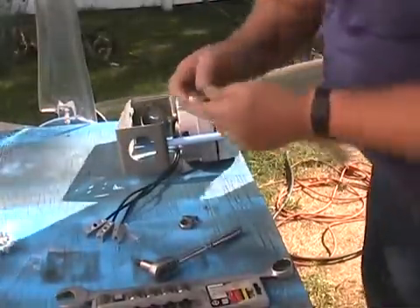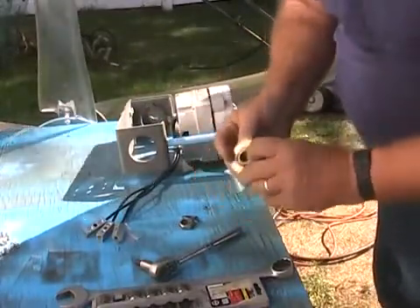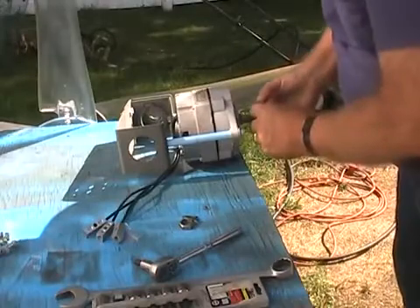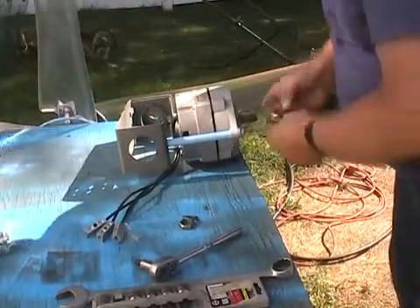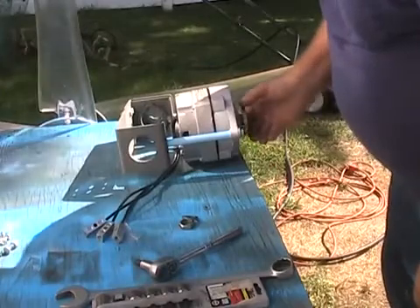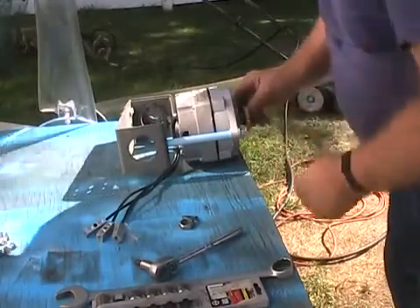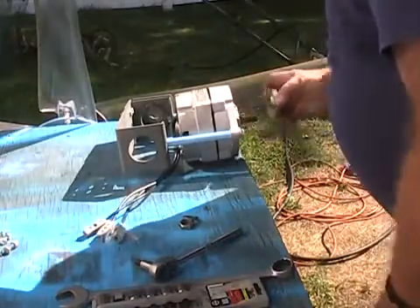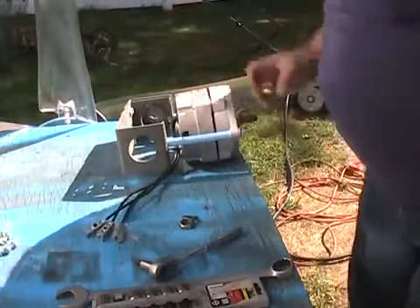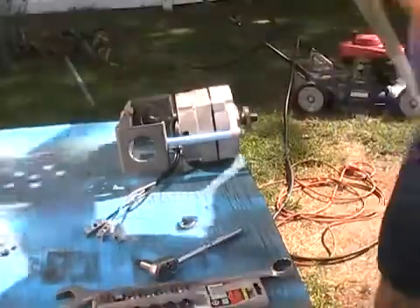This spacer — you see how it's shaped? This big heavy flat side goes out towards the blade; it does not go inside. By putting it inside, it actually impairs the blade's ability to turn. So make sure that when you put this spacer on, it goes outside because it stabilizes the hubs.